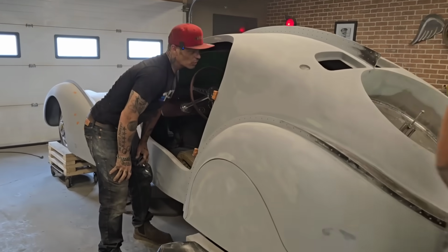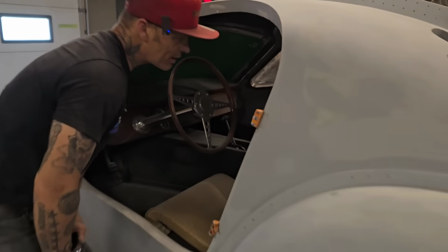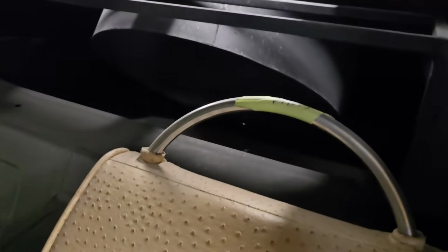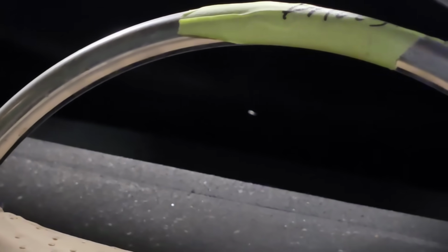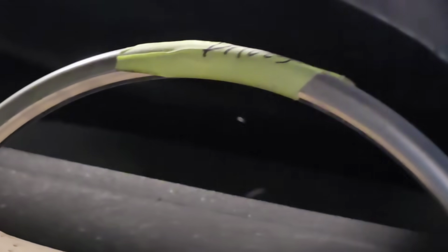Come take a look at the hole sweep here. You can see where it's at and how far away from the floor I am. See it down there? You can see the hole right there. It's quite a ways, isn't it? I need enough room to shove a piece of pipe on it. So I'm just going to shove it down there 1 inch. Then I'll be able to shove a pipe on it and down to the floor there.